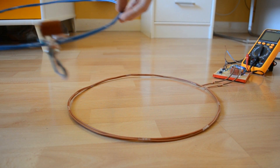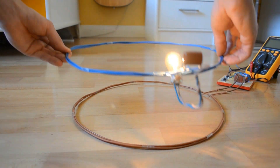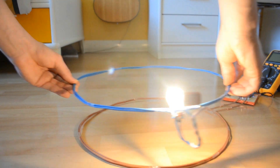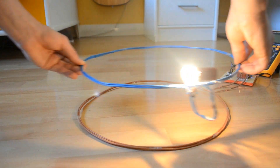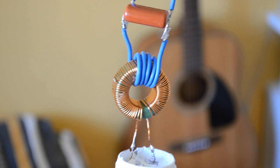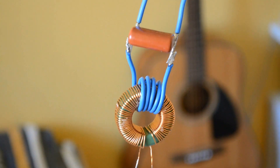Another test with a 21W car light bulb — the overall efficiency exceeds 50% with a distance of 10cm. To power a compact fluorescent lamp, we use our simple driver made with a ferrite core transformer, in order to increase the voltage at the expense of the current.